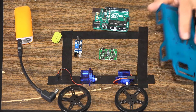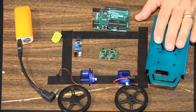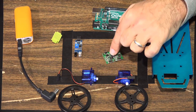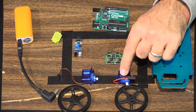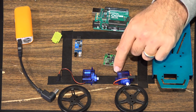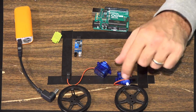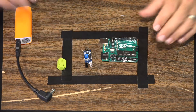The first thing I'm using is the Fetec vehicle platform, which I use for a lot of my projects. The Fetec platform comes with this little two-channel SM controller. What this does is it makes the electric motors appear to be continuous servo motors as far as the Arduino board is concerned. I like this because it's very low power, very easy to use, and very small. We also get the small motors and those large wheels.